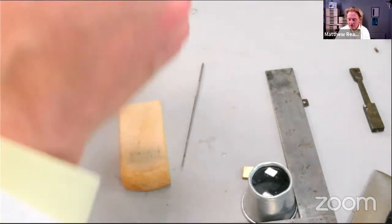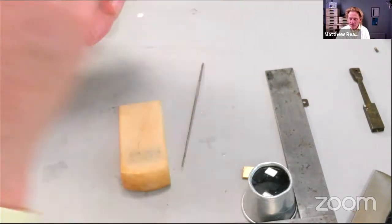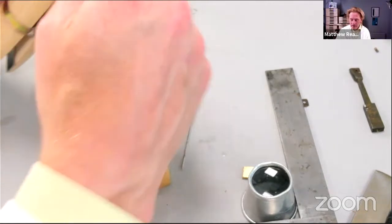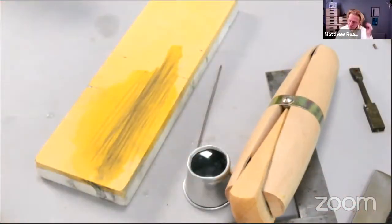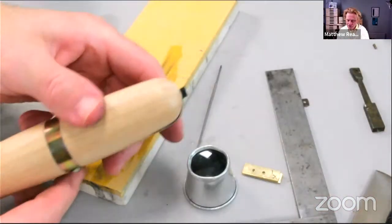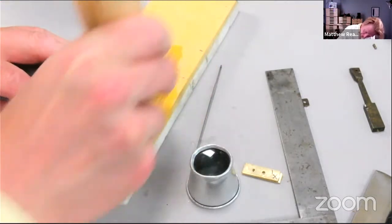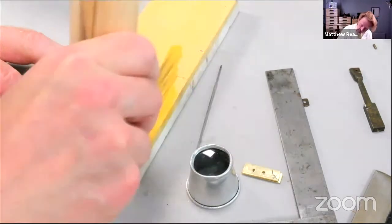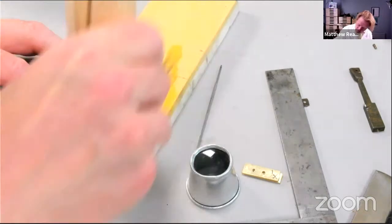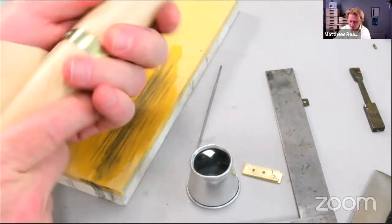This will close the holes again, a little bit, but there's so much tolerance in there. The thing is, as long as the holes are bigger than the hole in the brass, once it's riveted, it'll be fine. So I've got the spring end there. This is the upper end. Just going to turn it flat, the end where I snapped it off, and then pull off the corners. Nobody will ever see it, but it makes it a bit smarter inside there.